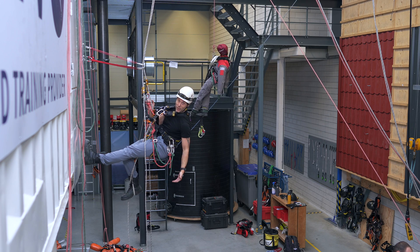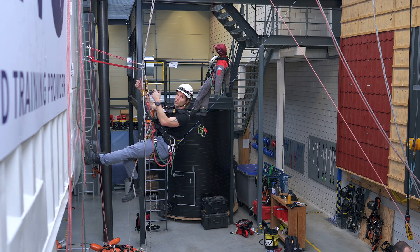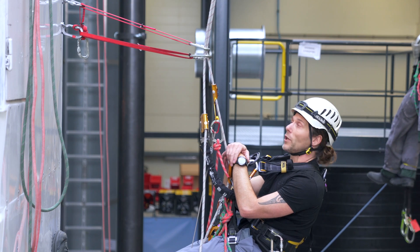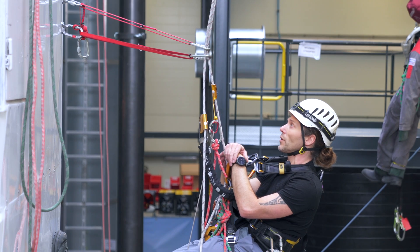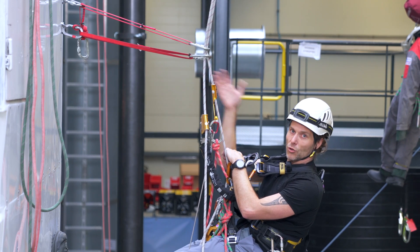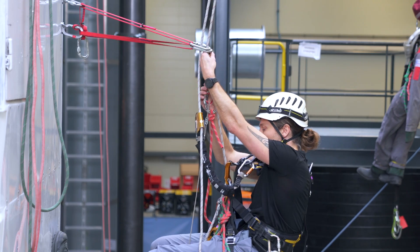The hazard is below me, so I could actually just open them, swing out, swing back in and clip in. But most people in IRATA and in the rope access world would like to see you always attached to two points towards the wall. So what I'm going to do is climb up a little bit higher.